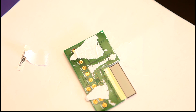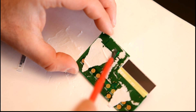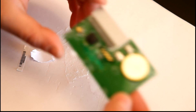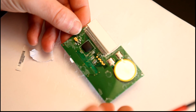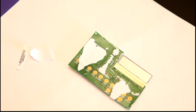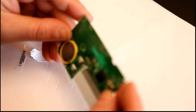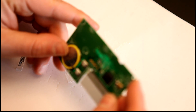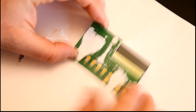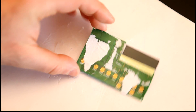Now often in the case of these security devices there's going to be some sort of anti-tamper device, and it wouldn't surprise me. You do wonder whether there's some sort of capacitance sensing or something in there, or whether it's just ground plane. I can't see any obvious tripwire circuits, but if these things are designed properly you won't find them until it's too late. It looks like it's just a two-layer board, and it's extremely thin — a fraction of a millimetre thick, almost flexible — but it does appear to be just standard FR4 rather than anything clever. And it's incredibly sticky.